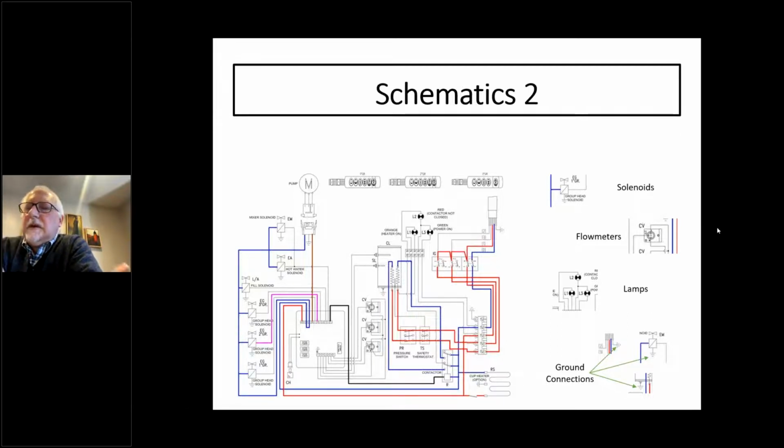Now, the one exception is on low voltage components, 24 volt, typically 50 volts or less, but on espresso machines, 24 volts or less. Because 24 volts isn't enough to do any damage to you, and generally the amperage is very low, a ground wire is not required for low voltage components, but it is required for everything else. Okay, we can move on.